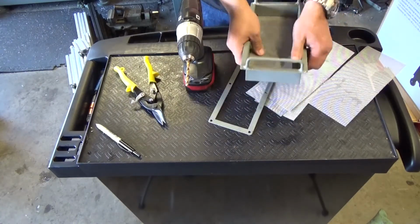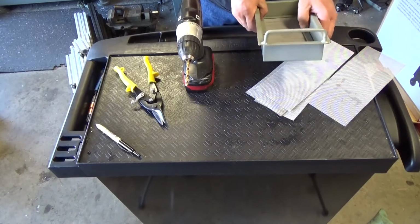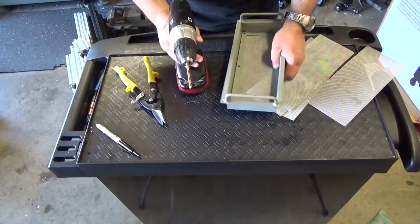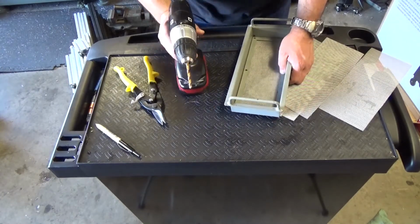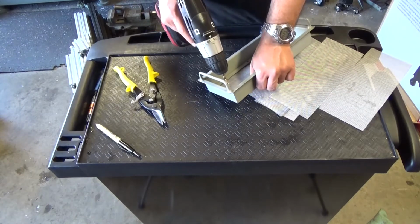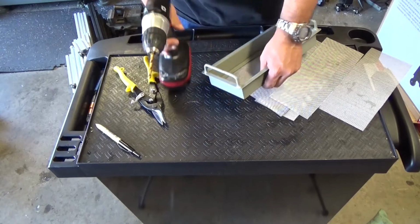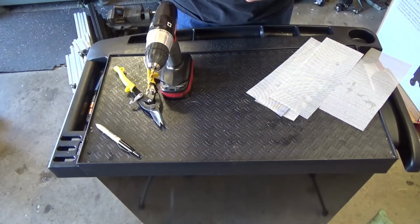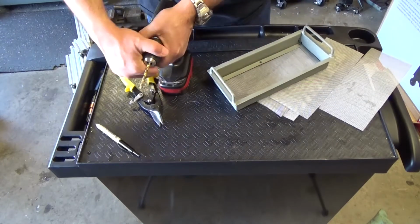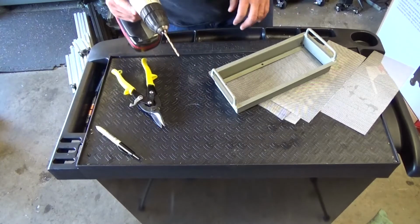Right now I'm going to put my first unit here. I'm going to put this guy back, and this is a 7/32 cheapo Harbor Freight drill. I imagine this will be enough. But you know what? I've got to be careful because the other side is threaded, so I definitely don't want to use too big of a drill. I'm going to use something else. Right, I'm going to go with a 5/32.